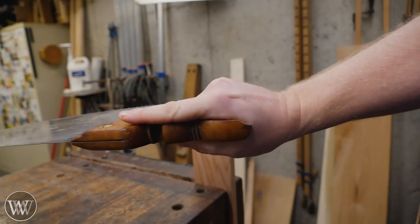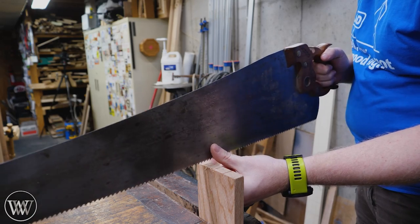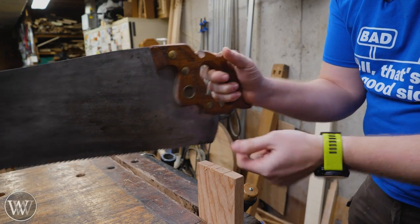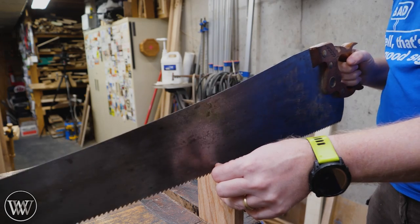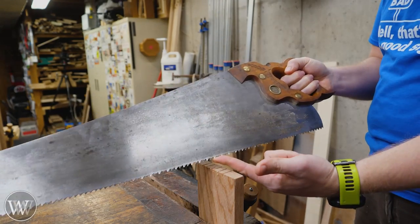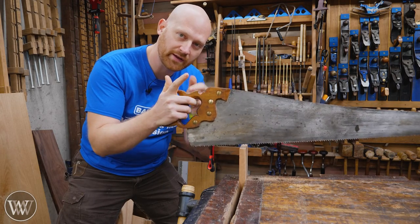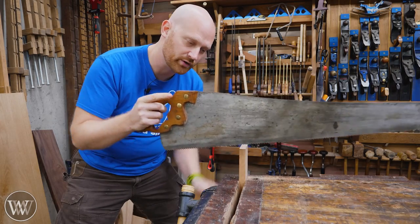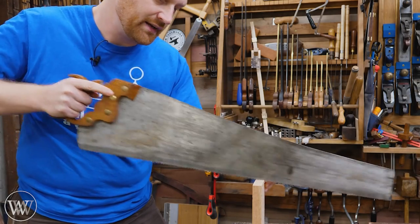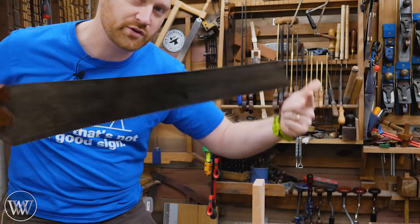When gripping it, I have three fingers coming through, one pointing forward, and the grip isn't very tight — just holding the saw loosely in place. What that allows me to do is actually move the saw above the board and just kind of scratch as I go, not actually cutting into the wood. I'm holding the whole weight of the saw off with this back horn, which gives me full control to put it exactly where I want. Then when I want to actually cut, I just put a little bit of weight into the saw and now it's cutting. My off hand controls exactly where the saw starts; my dominant hand balances between the finger and the back of the palm to lift the saw up and down, letting me put the exact amount of weight I want and start on the push stroke every time.